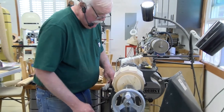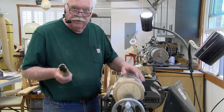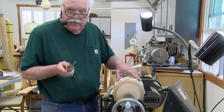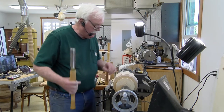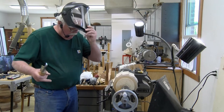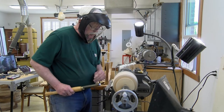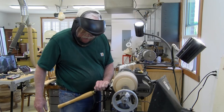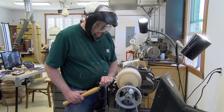All I'm really going to do is just knock these corners off, and I'm going to do that with a spindle roughing gouge. Even though it's considered a Beads of Courage box, it's a spindle — the end grain is going from tailstock to headstock — and all I've got to do is knock it off with this. I'm putting my face shield on, keeping it down low. I've got another secure check, everything locked, tool against my hip, doing a bevel anchor cut.